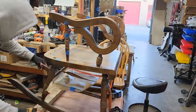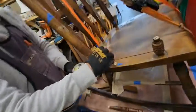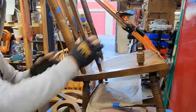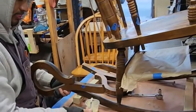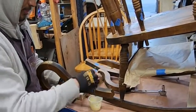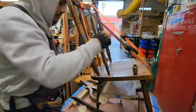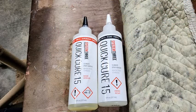We're doing both the left and the right side. But before we do all that, what we're going to do is we glued on the rest of the backrest of the chair. And now we're going to put it together. We're using carpenter's glue on part of this and epoxy on the rest. So you saw carpenter's glue going right into that spindle joint. We always apply glue to both parts of our glue up, not just one part. I found this gives us a much better chance of not getting adhesive starved. We like to see glue squeeze out.